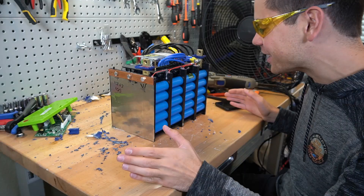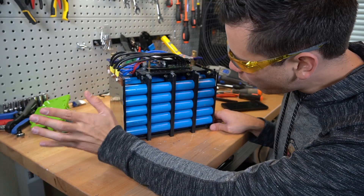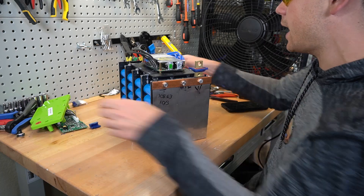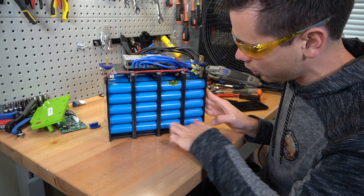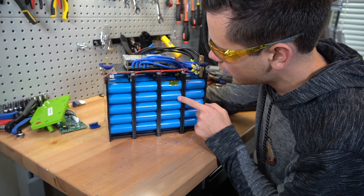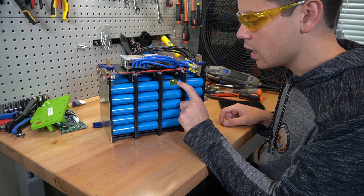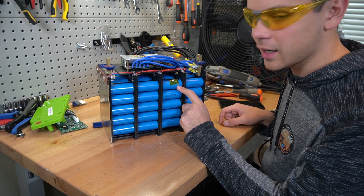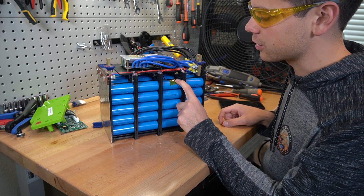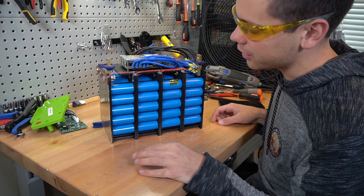I can actually recommend it — finally we have a good battery. I was scared we would find something bad, but everything looks good. If there's only one thing I could suggest, it would be a second temperature sensor on the bottom of the battery. We only have a single temperature sensor, and if it gets really cold at the bottom but hot at the top, that could be an issue — though it's unlikely because the case is thick and well protected. Having one on the opposite end would be better. There's also a possibility the disconnect threshold is set at a higher temperature than necessary, like 40°F instead of 32-35°F, for safety headroom. It's nice to see the temperature sensor is connected directly to the cell.